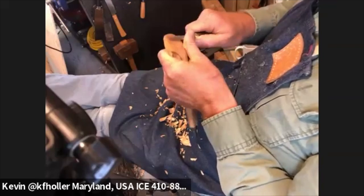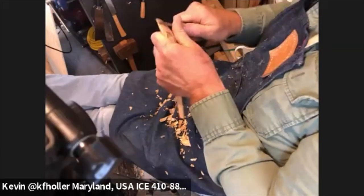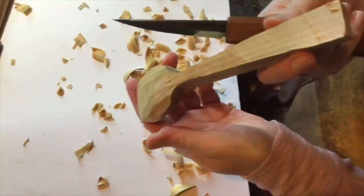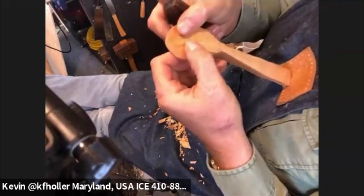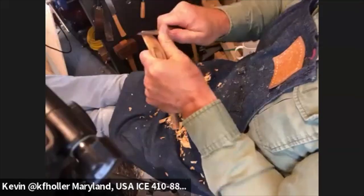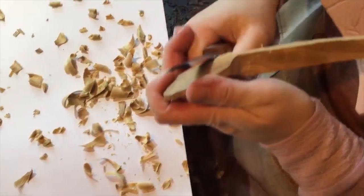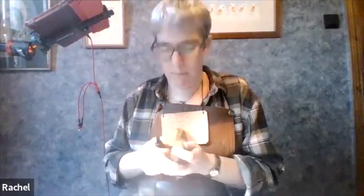In the middle of the back of the bowl, I'm also going to cut out any axe marks that are there. You want to get underneath all the axe marks. I got under all the axe marks, but it's not a final pleasing spoon shape yet. No, but it is pretty symmetrical. Mine is not, because I have way more wood here than over here. I sort of even it out so there aren't too many lumps. After I've done the front of the bowl, I come down from that highest point. I haven't done these parts yet. I'll do those points after I've run down the handle, so that I can establish the center high point.